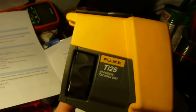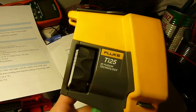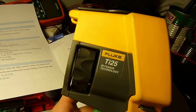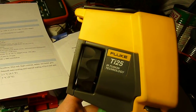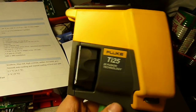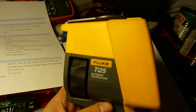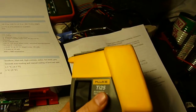That's one interesting fact. If you're doing any type of building maintenance or building envelope inspections, you need to get the TI32. It has higher sensitivity under 50 mK, which is typically the recommended sensitivity for building inspections, roofing inspections, and so on. The TI25 is more suited to mechanical, industrial, and electrical diagnostic work. The TI32 is the next model up and will do pretty much everything the TI25 does. Each one has its own applications and uses.